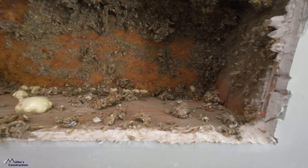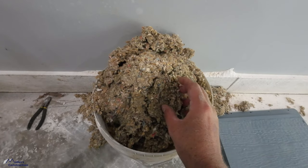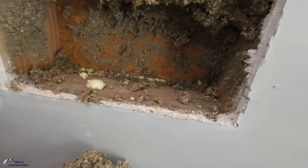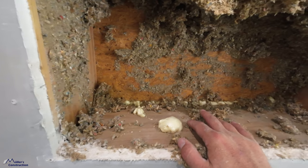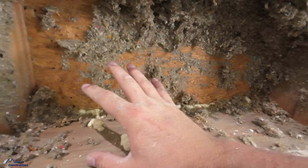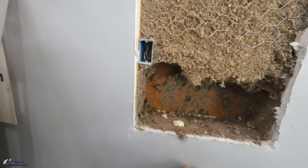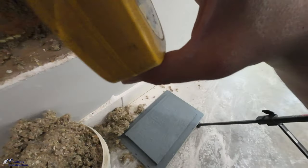A little up close and personal. If you're not familiar with damp sprayed cellulose, this is it. It's nice and dry. You have to understand how this stuff works. You have to let it completely dry before you cover it up with drywall. We run fans, dehumidifiers, and you can see after 5 years, this zip sheathing is rock solid, no dampness about it, no rot.